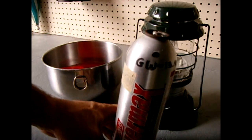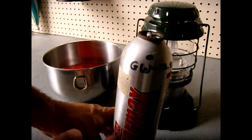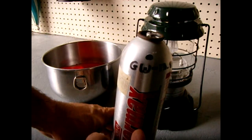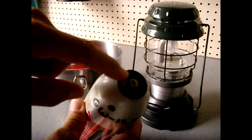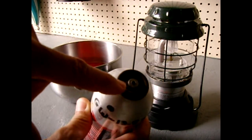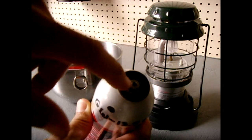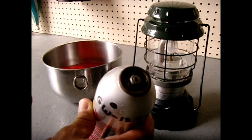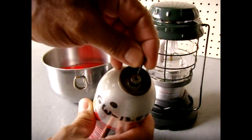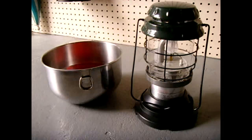Before you attempt to fill one of these cans after they're empty, definitely inspect them. Make sure they're not corroded to the point where you worry about a hole blowing out, and make sure the end isn't corroded and beat up. You also have to realize you can only fill these a few times because there's an o-ring in there that eventually wears out. If it doesn't seat, just gently push down on it to get it to reposition, then it seals.